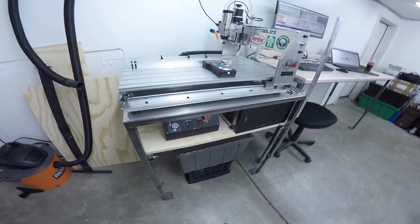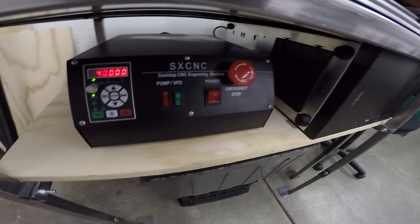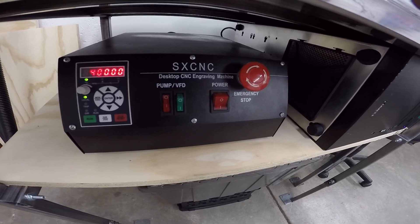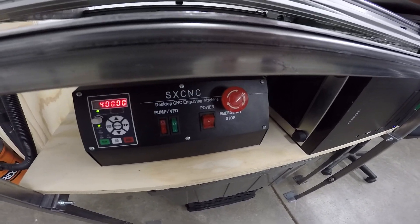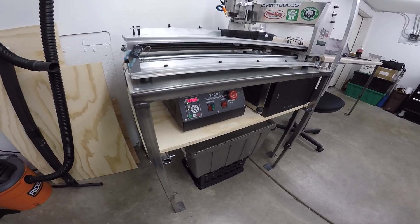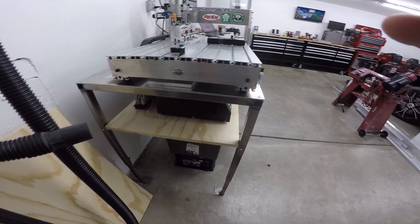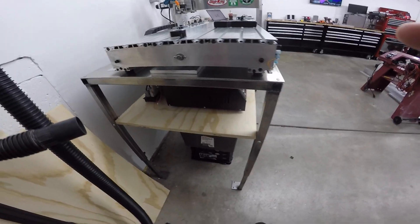Before my machine even got here, after reading the forums, I opted to order the Gecko 540 controller, which turned out to be probably the best thing I could have done. The standard Chinese controller that came with this had nothing but problems. The setup instructions were actually pretty good, but no matter what I did — and I have pretty good experience with Mach 3, having set it up on my own machine and helped a few buddies — I could not get it to control this machine. I tried Linux CNC, got that working, tried a few other things, and finally got it working in Mach 3 but with completely different settings than what the manufacturer specified, and certain things were still a little off. So I opted to go with the Gecko 540.